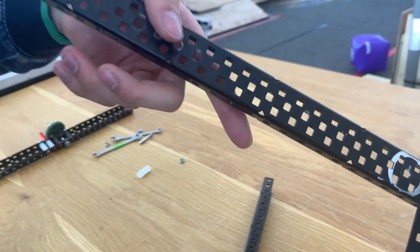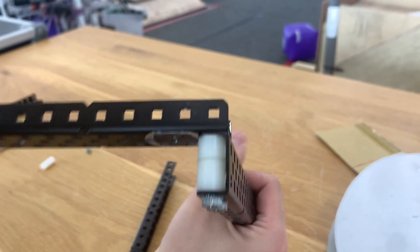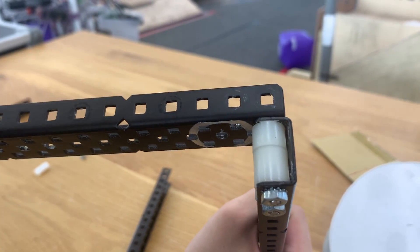But if the entire support is boxed, it will be really hard to twist. Now that everything is constrained together into one piece, you have to twist the entire piece of C-channel together, so it's going to be a lot harder to twist and therefore a lot stronger.